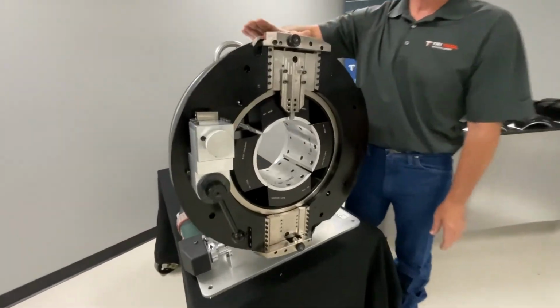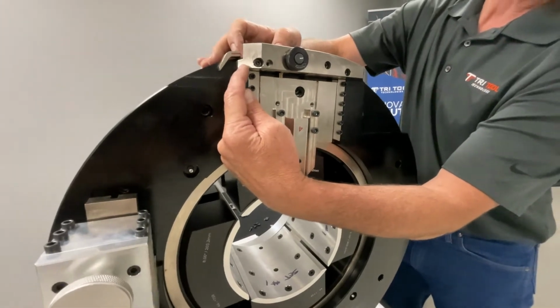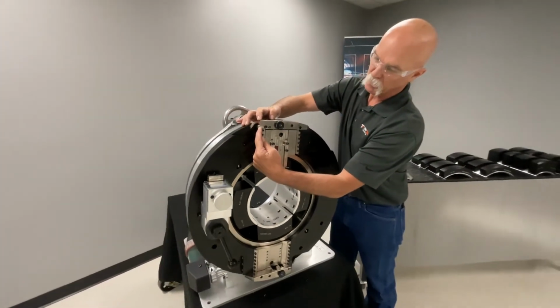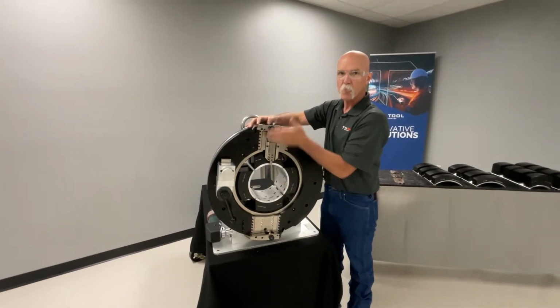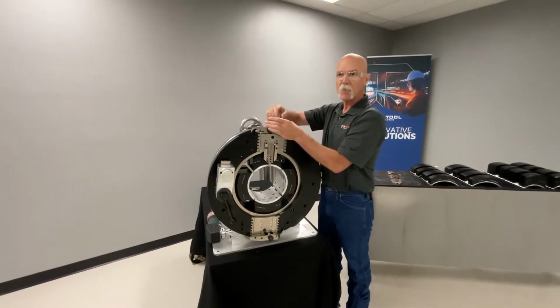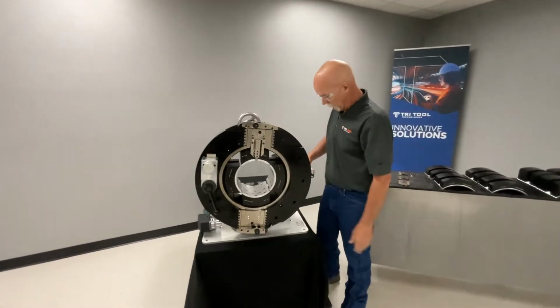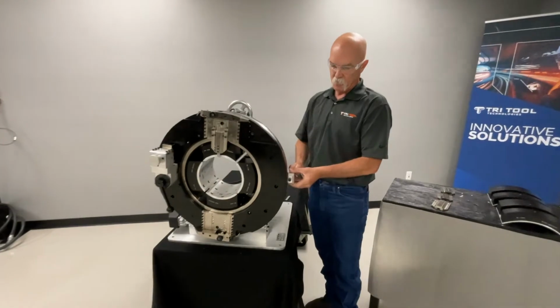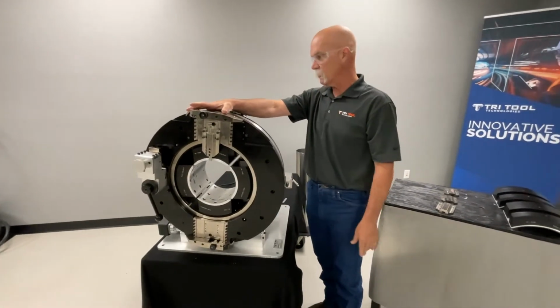The AC means auto cycle, so as it trips, it has a feed rate from 1 thou to 5 thou that's adjustable on your feed rate. Once it cycles through and cuts all the way through the pipe, it'll automatically retract, so you're not having to pull tool bits back. Then you can just slide to your next cut line. It has a tripper on this side. As it rotates, the feed arm hits that, and that's what cycles it down.